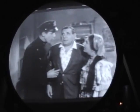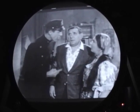And as we can see now, I can crank this brightness up all the way, no retrace lines. You get some distortion, but that's just because you couldn't drive the picture tube this hard. But otherwise, no retrace lines. All right, I say this chassis is all ready to go back into the cabinet.